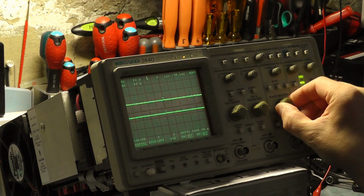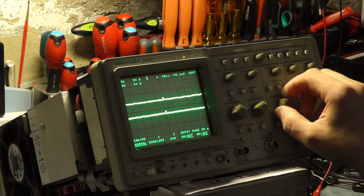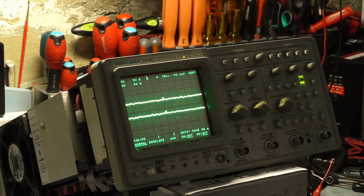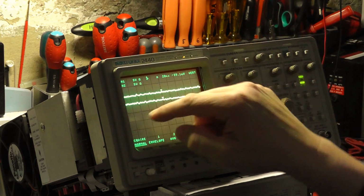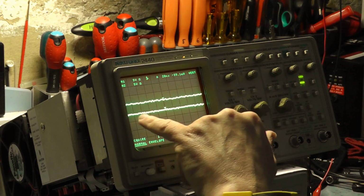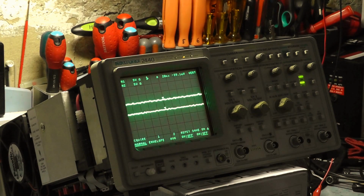And that happens, I think, over about 10 microseconds. Now you'll see in a moment, 10 nanoseconds. We're now in that mode. We're now using the CCDs for checking. And if your CCDs are faulty, if I wind this position up here, if you remember from the previous video, you get a load of scattered lines. We're not getting that anymore. We're getting the classic CCD, slight disturbance in the waveform. It's exactly the same as what the other one does.